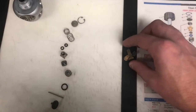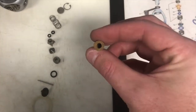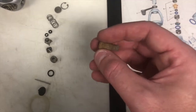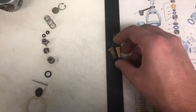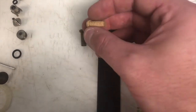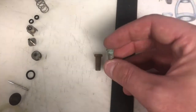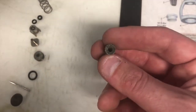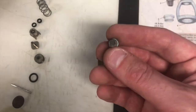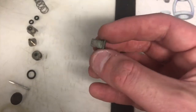Here's what a filter that looks dirty or corroded looks like. This is a conical filter — it didn't come out of a Titan regulator, but you can see a lot of corrosion on it. Now if you were just looking at it the way the customer was before we took it apart, it doesn't look that bad, but once we pull it apart we can see there's a lot of corrosion. To compare, here's a conical filter that's relatively new — much cleaner, no corrosion, almost shiny. And here's one more showing all the salt water corrosion that's green in color — that tells us the filter was being exposed to a lot of salt water, not being rinsed properly, and probably put away with the dust cap on trapping salt water inside. This filter corroded all the way down.